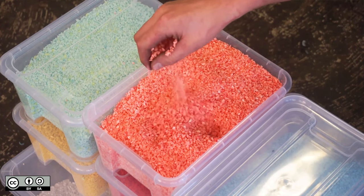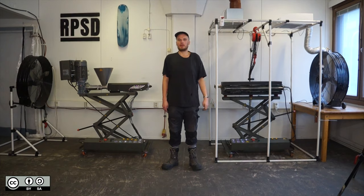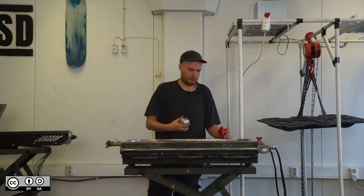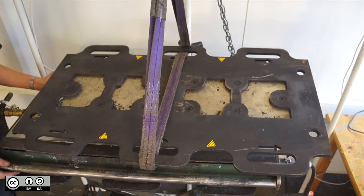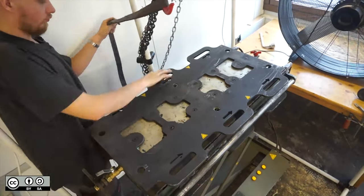Make sure that you have a good source of plastic available. We recommend polypropylene. Start preparing the mould by opening it. Once you've loosened the bolts, take off the support structure, undo the brakes and remove the mould. Apply a layer of silicone oil. Sprinkle a little bit of plastic by the entrance of the mould. Lower the top face back on the mould, reinstall the support structure and bolt it closed.